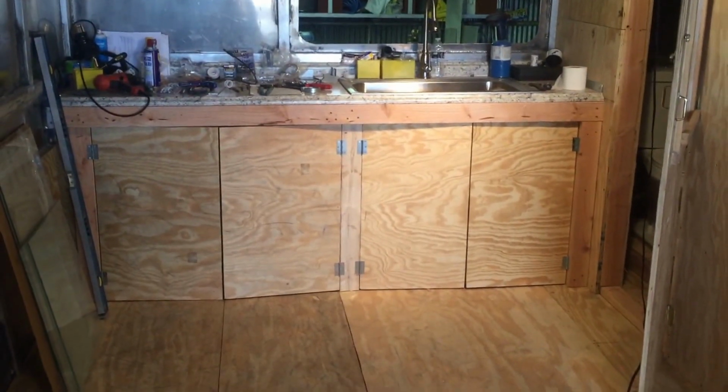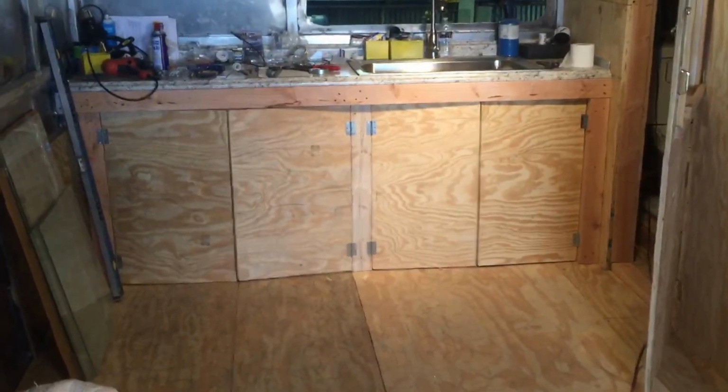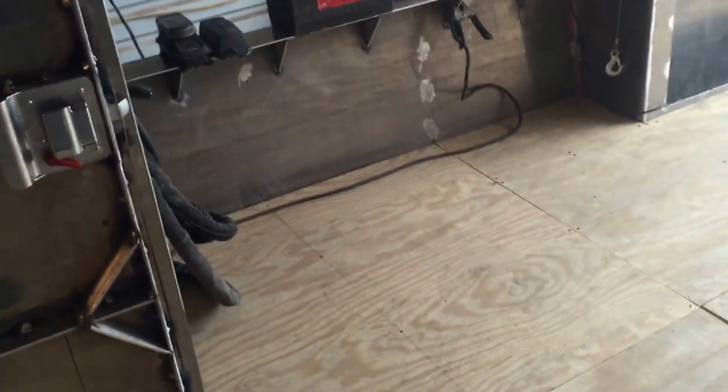Everything in here is done. The septic system is done. The water system is done. All the through-hole fittings are done. Out front here, I have a fuel tank under here, and I've got a deck fitting that I'm going to put over there by where that battery's at. I don't have hoses and stuff to hook up this 100-gallon fuel tank. But in this compartment right back here, there's going to be a bilge pump because this is open to the weather, and there'll be a bilge pump in that compartment that's divided with one of the bulkheads.